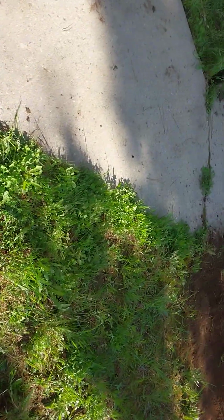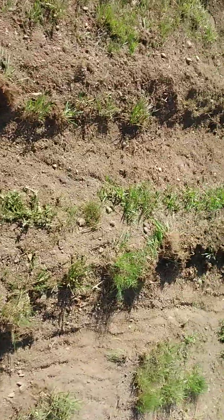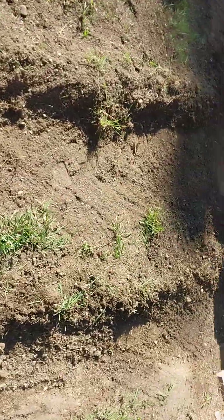So I put in a second swale below it. And these are micro swales. These are 1 foot wide, roughly. Maybe 4 inches deep. Not really very deep. They're just enough to take that roof water and move it from being an erosion factor. And then I just took the debris from the grass that I cut out, and I made a third little minor swale out of it. And they'll decay and they'll settle down over time.